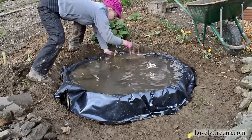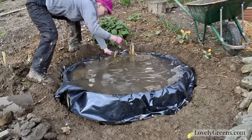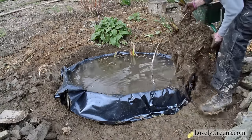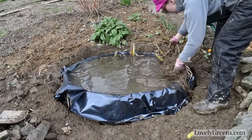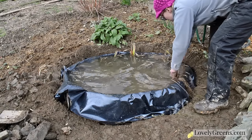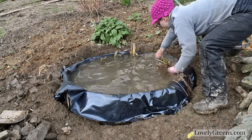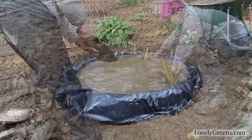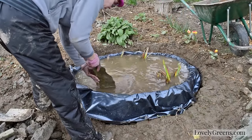It's recommended that you wait 24 hours after filling your pond before you start putting down the permanent pieces around the edge and refilling it with plants and animals. This is because the pond needs a little bit of time to settle, and also because city water will often have chlorine in it, and 24 hours will give it a chance to evaporate out.